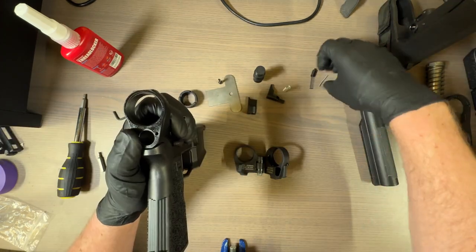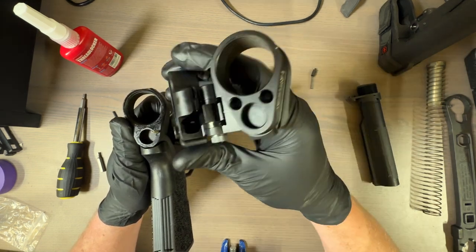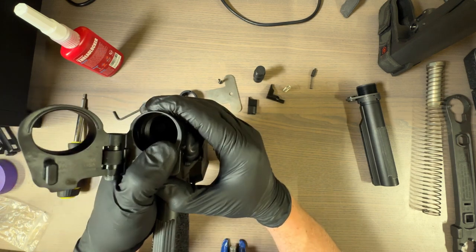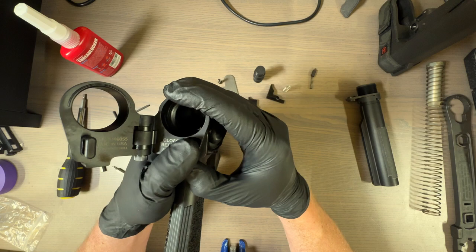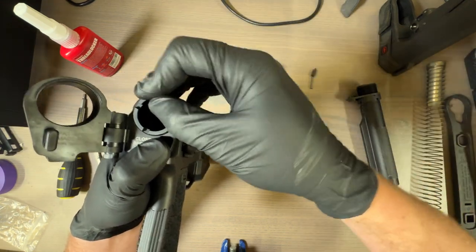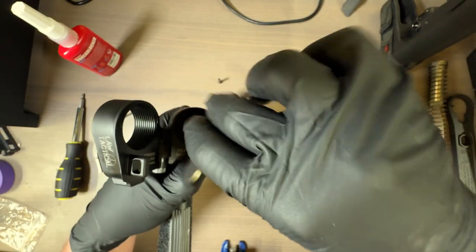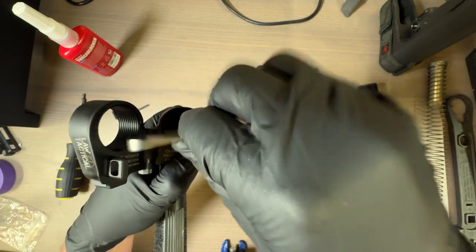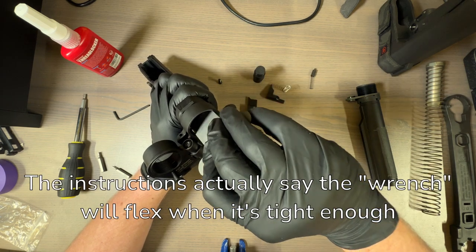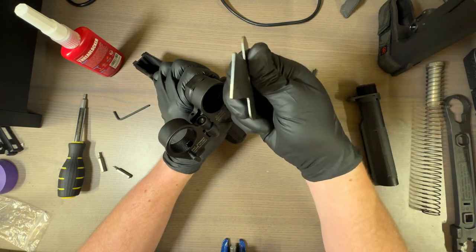We need to take our takedown pin and put it back in with the detent and the spring. Press it down — slow and gentle. Now don't let up on this. Press it down like that, and that is how I recommend you do this so that we can take this bit, drop it in here, and we can take this little flex driver — whatever they call it. It's not in there all the way, and as I said, this is literally going to flex. You are going to feel it flex. You just have to put some gusto in it. It flexed — we're good.